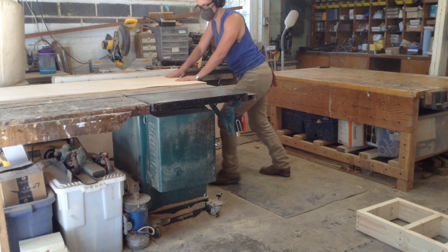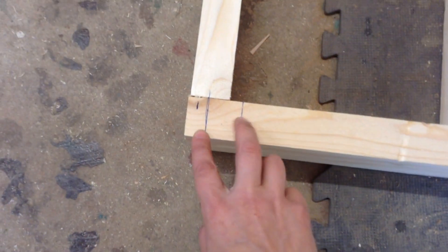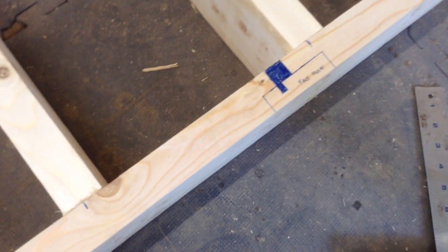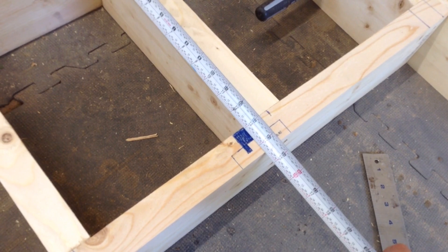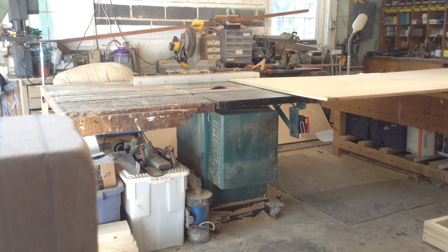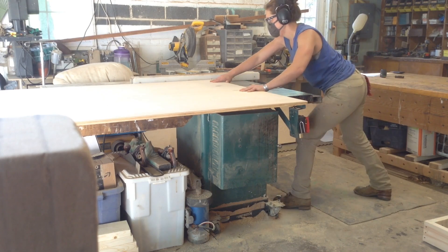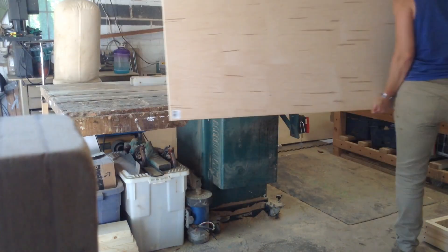I can go through and cut all of my widths and cut them down to length. The back cabinet is going to come completely apart — it's about four feet wide, a little less than eight feet tall, and two feet deep, so it's quite large. For the sides, I drew out where the carcass is going to be, where it intersects the face frame. I can measure from my depth — the two side cabinets are the same depth, about 16 inches — subtract what I'm adding on with the face frame, and rip down my sides. The two back cabinets are completely different sizes from the side cabinets.